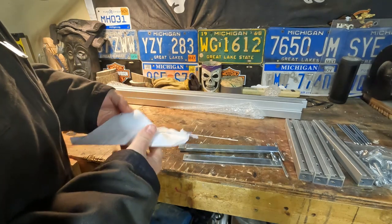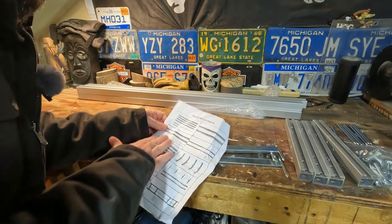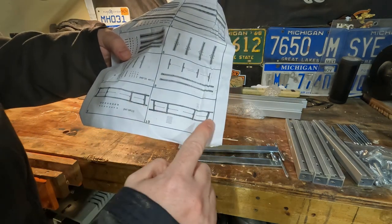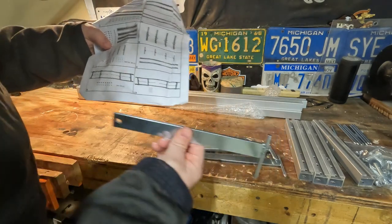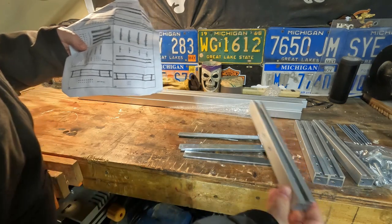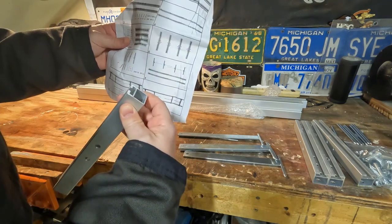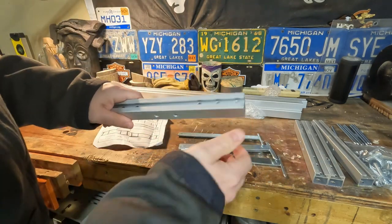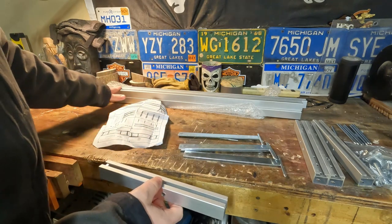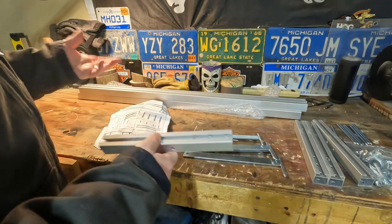Okay, so what is this thing, right? This replaces the 2x4, and this is all the instructions they give you, so cool. So you can tell what this is. Basically, it makes two rails with a bunch of crossbars and these things right here that kind of hammer down to hold it in place. These bars here, there's screws that go through it. Kind of can't tell on here. Is there a good way to show it? No. But essentially these bars have some screws that go through that you can adjust and level this out so that it sits level on the log. Then from there, your chainsaw mill runs on top of these and it makes a nice, smooth, level, flat surface to run your chainsaw mill across and cut your first cut.